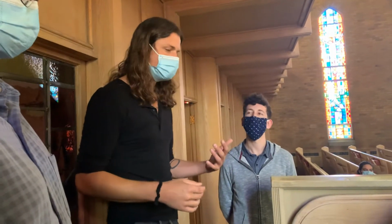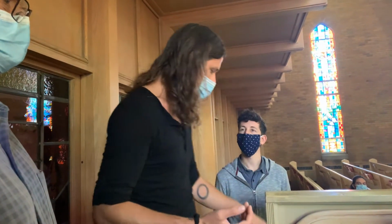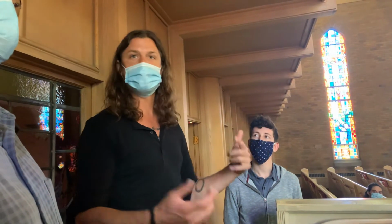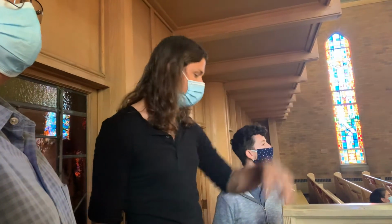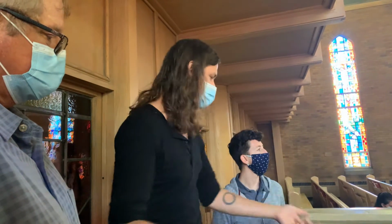So I imagine that the podium and lectern, the pulpit and the lectern microphones are probably condenser microphones that require phantom power. The two on the stands there by the music stands, they probably don't. But since they're 1 through 4, you have to turn them on for the pulpit, so you might as well just leave them on for the other two, right?